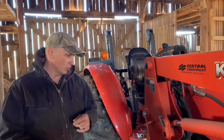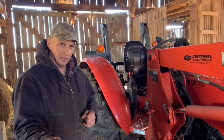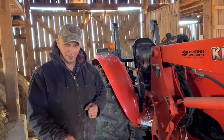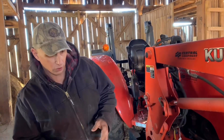One thing I do want to throw in about the weights though is 8,000 pound in a gravity bed versus 8,000 pound on a trailer is a lot different. Okay, most trailers you work with, you try to get the axle positioning about 60-40. You want 60% in front, 40% behind.